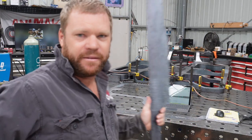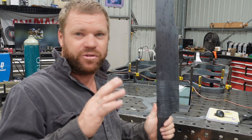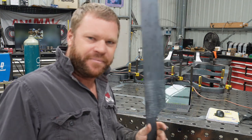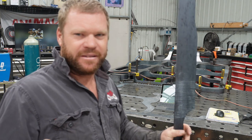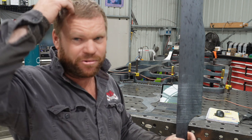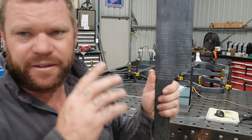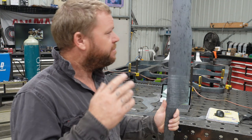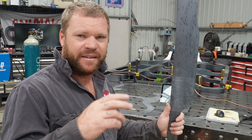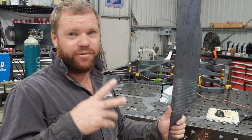Alright, well, I've been going back to the computer, referring to the drawing on there, and you can create a flat pattern, which gives you a bit of a layout. It's kind of confusing to me, looking at the computer, trying to work it all out. But I've got the four main big corner bends marked out. So I'm going to bend them up on the pan brake, and then for the section that goes around the engine mount, I'm just going to use my little tuning fork.